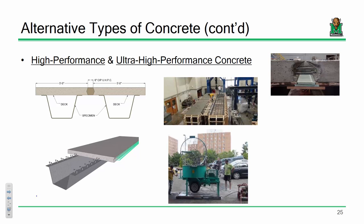The idea is that instead of cutting and welding a steel girder together, you take a standard mill plate directly from the mill or the service center and, using a large-capacity press brake, just bend it four times into a U-shaped tub, cast a concrete deck on it, and ship the whole composite unit to site. Set it down, close this up with a UHPC closure pour. You can have your whole superstructure done in a day as opposed to how long it takes owner agencies to put bridges up now.